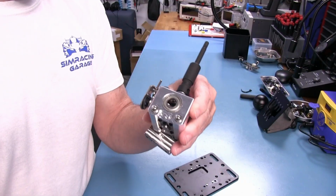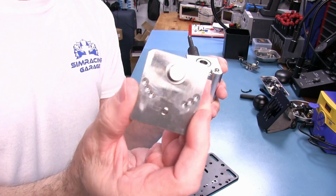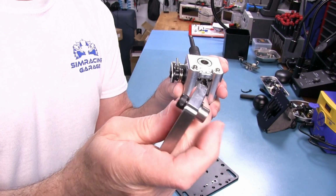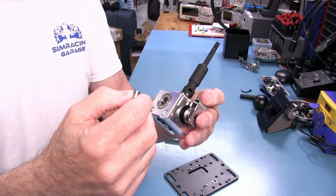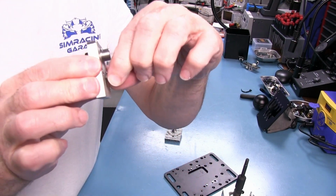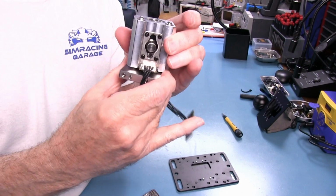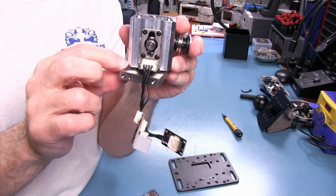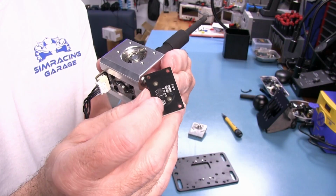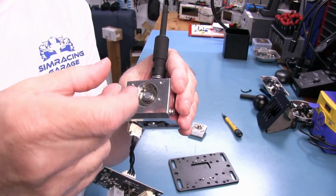The HGP has a very robust looking internal assembly with 8mm thick steel pivot arms securing a single billet block of CNC machined aluminum that contains all of the lever mechanicals. The setup uses self-contained spring ball units that ride in round divots that are machined into the 8mm steel pivot arm. This simulates switching between gears. Although I like the design of this setup, I would have rather seen some type of tensioning system incorporated here. All shifts are picked up by a Hall-type magnetic detection circuit, which should provide a long life cycle.